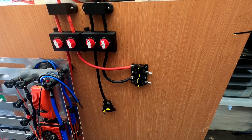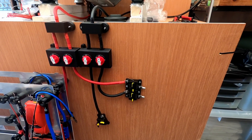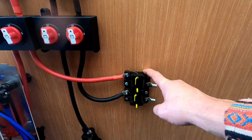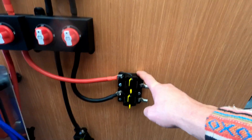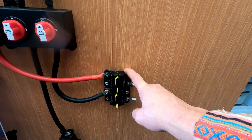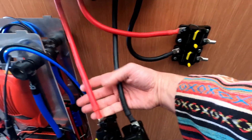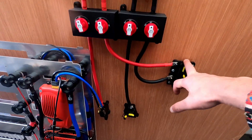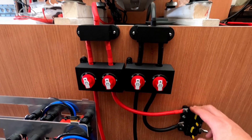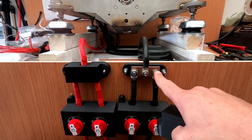Since the last episode I've done some cabling work, so I thought I'd just walk you through what's been done so far. We're getting closer to actually being able to connect this to a 48 volt battery and hopefully see something spin. The entry point are these trip switches — 200 amp DC trip switches. I've catered for a primary battery and a secondary battery, so when I'm on the boat I'll first install a primary battery, and if I later need a secondary battery, I have all the cabling pulled up. The cables go up to a set of isolation switches, placed close to the battery so I can isolate a battery if I need to work on it and still keep the rest of the system going. That goes up to the three-way splits that I created.